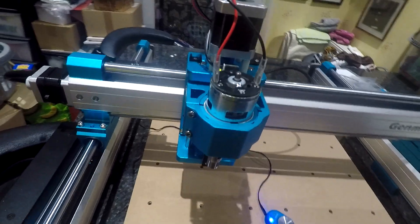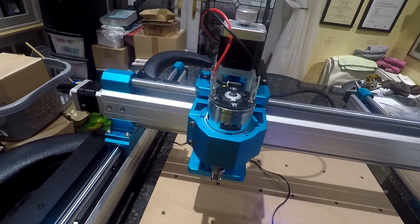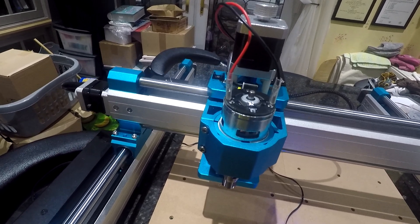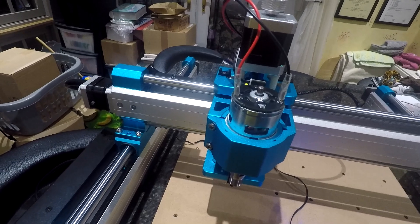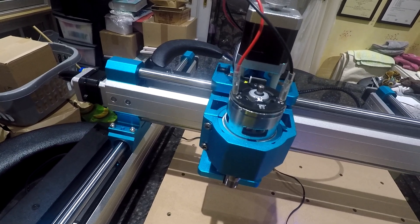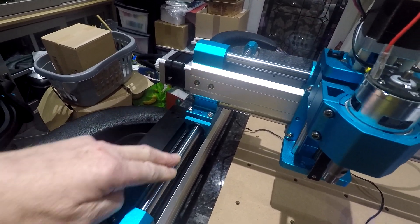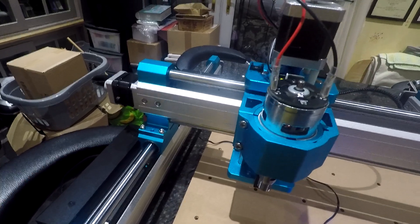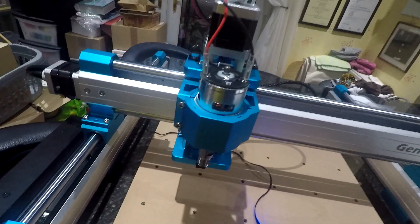My 6090 downstairs has an inch ball screw shaft underneath that drives both Y axes — a lead screw. It's all cast, really heavy. But it's a professional one. It runs on rails, one at the top, one at the bottom, either side, and same on the X axis. So I consider it really professionally made. This, for the value for money, SainSmart do have a lot of offers on. I suggest that people thinking of buying one — if you want it in a 4040, this will do most things.